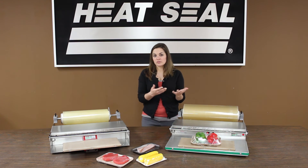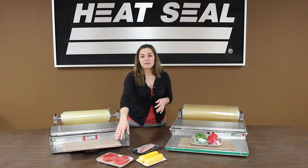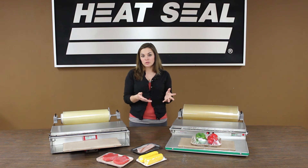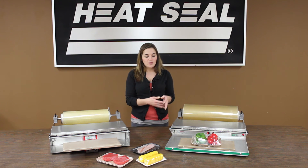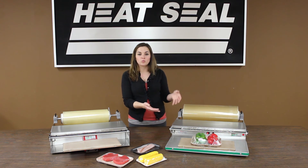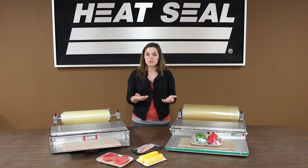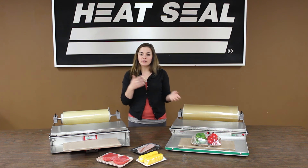The photo-eye sees the package and then starts the seal cycle. Another great thing about Energy Smart is that they're very safe units. The seal plate is not maintaining 300 degrees at all times, so there's less risk of burn compared to the old units. If you leave a package or something on the seal plate, after that 3 seconds it starts its cool-down process until you reactuate either the photo-eye or the rocker arm. If you're wrapping successive packages, it's going to maintain 300 degrees and operate really efficiently.